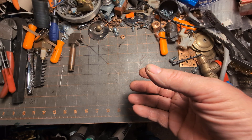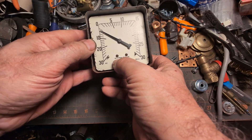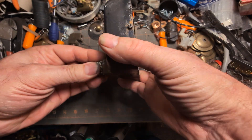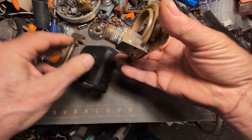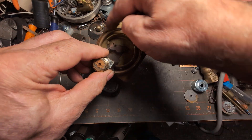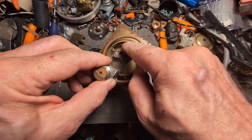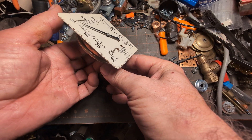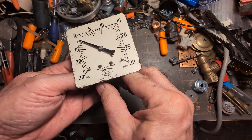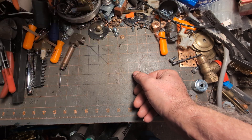Here's another example, and it also says 'internal siphon.' You're able to see the siphon here. This is the Bourdon gauge with its linkage — you can see I'm moving it gently here, and it'll move in another direction. Hence the name 'compound.' Later on they came out with a smaller gauge, and this is where we kind of get into trouble.